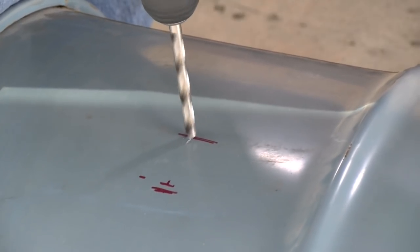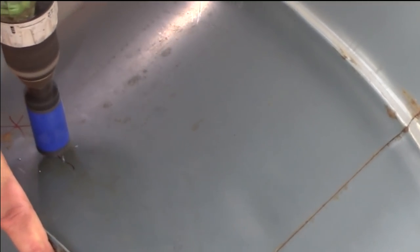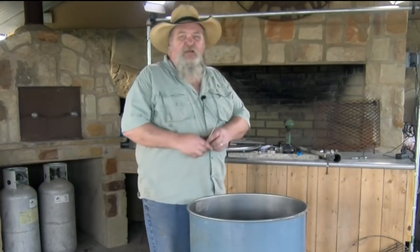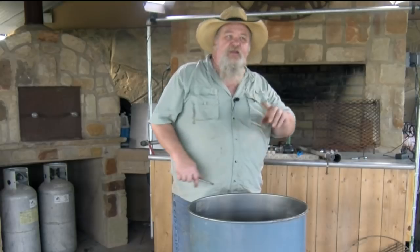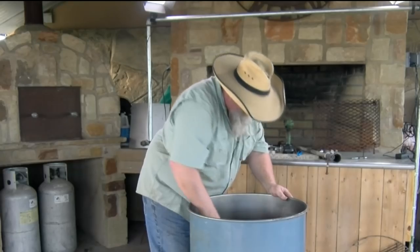I just took a punch and hit me a little hole there so I know where it's centered a little better. Going to drill this hole. Now y'all can see where I told you that first hole was off at two inch mark. Just flip ends with the barrel. Here comes our hole saw. Center drill. Now be careful when you use a hole saw. It will jerk that drill around if you're not careful. And there's that hole. So I'm going to drill the other two holes. Then I'll get right back with you. Now we have some sharp edges on the inside of our barrel where our drill came through. I'm just taking a screwdriver at an angle going to run it around that to knock those sharp edges off. Just want to knock the burrs off that might be on there. Get rid of those. If you have a little file or something you could take them off with that.